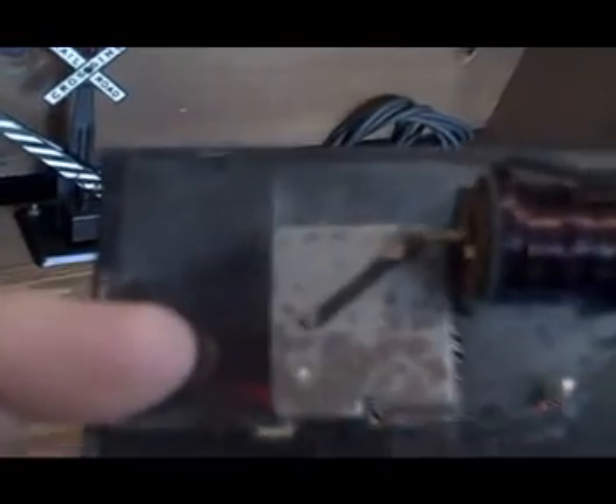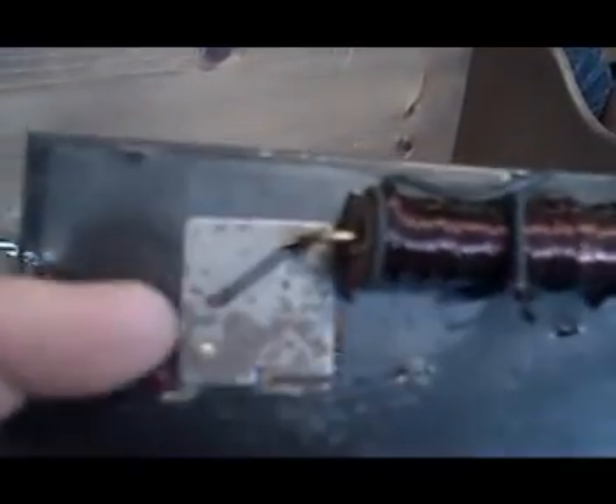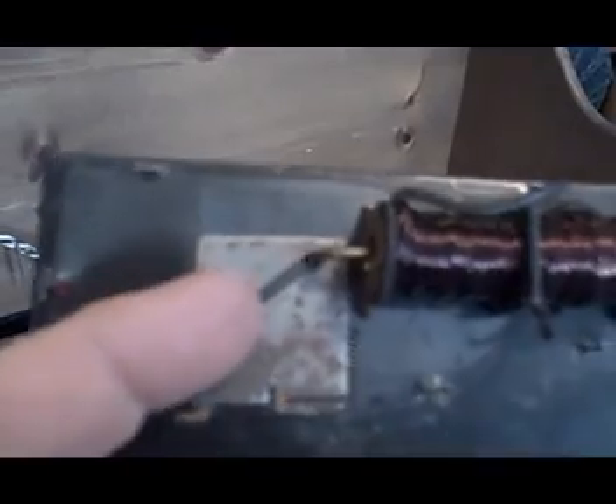At the ends of these metal plates — really trying to get tight in here so we can see it — there's a little area of horizontal slot. At the end of the diagonal slot there's a little horizontal slot, and that is where the track locks in. When that solenoid makes its full stroke with this little arm, the track locks in place at that horizontal slot.